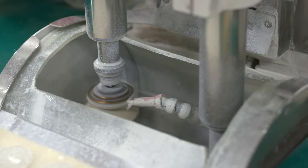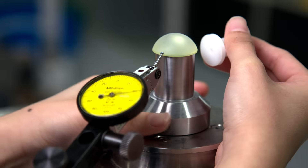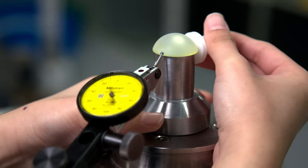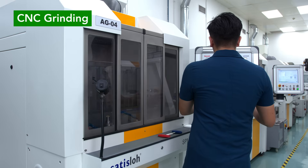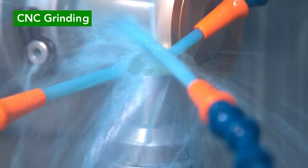The spherical or planar reverse side of the lens is polished before moving on. To prepare for computer numerical controlled or CNC grinding, the spherical part must be attached to a metal holder in a process known as blocking. A sub-aperture asphere grinding tool containing small pieces of diamond is used to remove material and begin forming the aspheric surface.